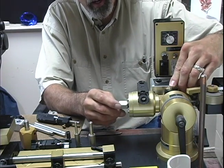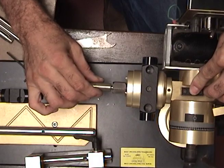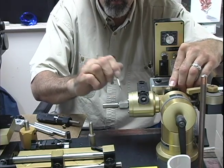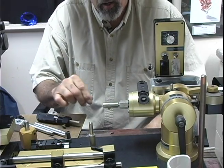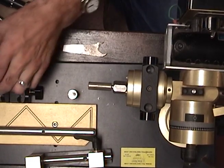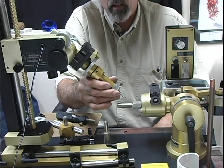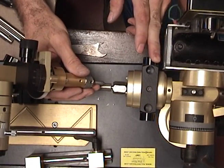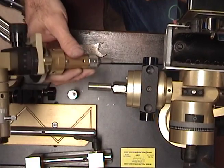I'm going to reach up here and press down to lock the arbor in place. I'm going to screw the lock nut down and tighten it slightly, then make sure that this releases. Now we're ready to set up the stop arms that hold the quill in place. Since the OMF machine is a concave unit, you don't sweep like you normally would on a flat lap — you have to be in a fixed position. There's a special DOP arm stop that we're going to attach that you brace against, so you're always coming up to the exact same position.